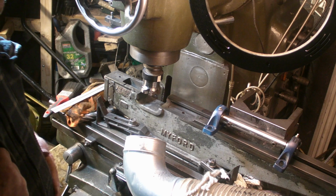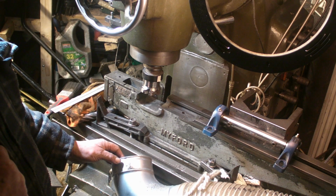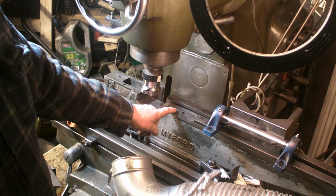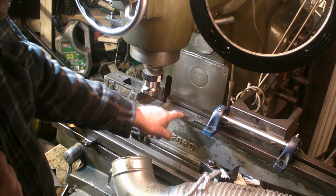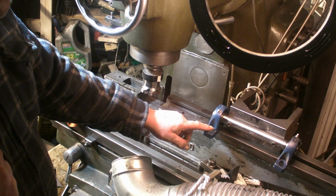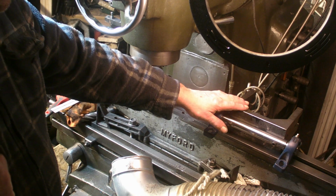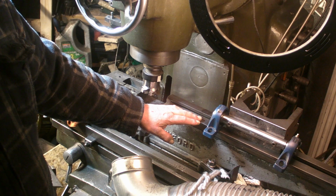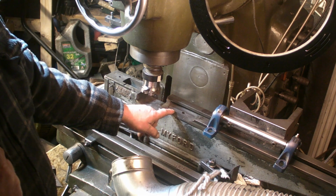Now at some stage I'm going to mount the pillow blocks onto the Myford ML4 bed, and I've started machining it down. I had a suggestion from one of my subscribers, Simon, at Wibbly Wobbly Idiot Vision, not easy to say. Instead of machining the surface of the bed down, which is quite a lot of work, would it be possible to mount the pillow blocks onto the side wall? And it would, but then the headstock wouldn't be centralised with the bed. Now in theory that wouldn't make any difference because you're not having to line up with a tailstock. There'll be no tailstock used on this machine.